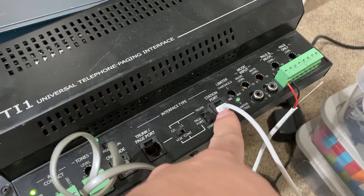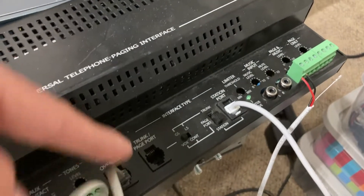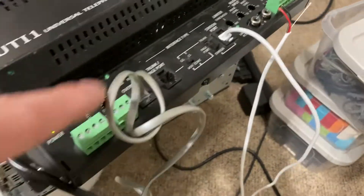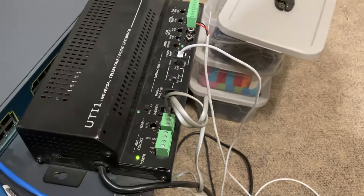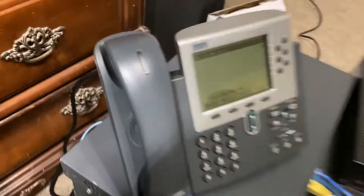The grand prize of all: the UTI-1. We have a 'station in use' and override. The override is on the FXO port — this one's on the first FXO port, and this one's on the first FXS port. This is 2030 and 2050. This is how Home Depot probably does their setup — they totally use the override, because every time they page it sounds really loud and you get the quad tone, and when you hang up you hear a loud pop go through.